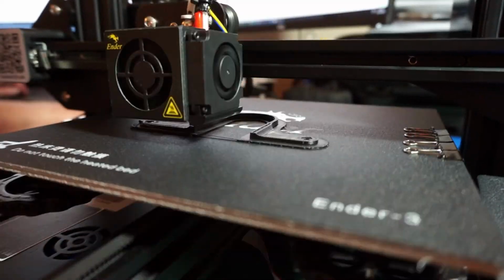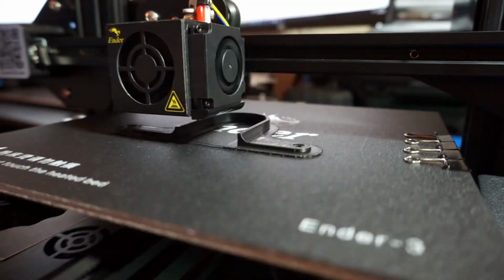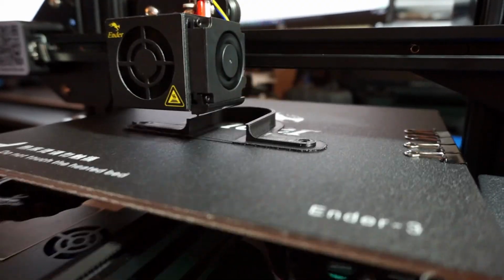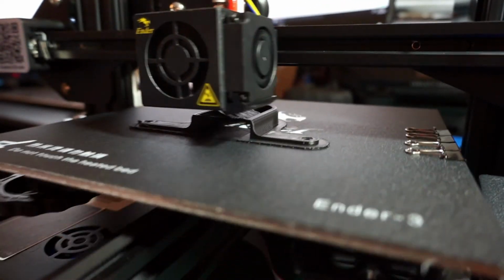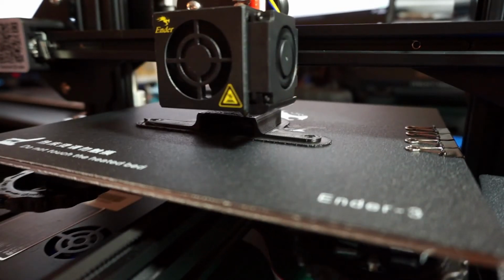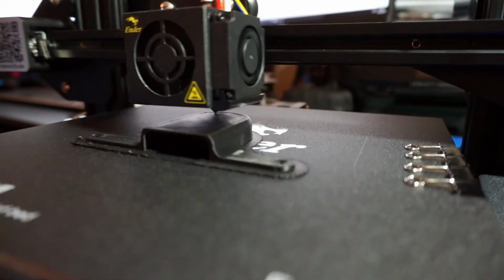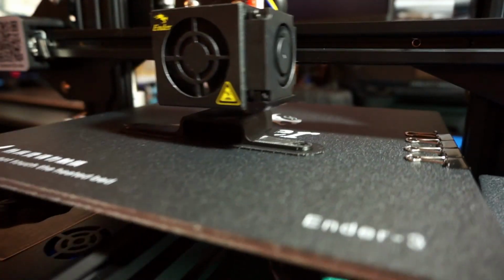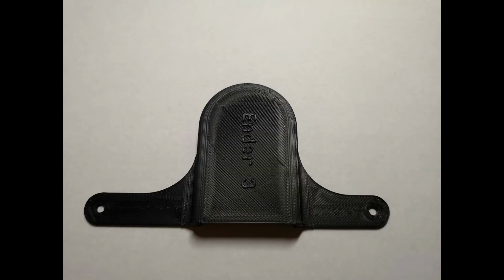Running the time lapse of the print that I did here, you will see if you watch through it where it spanned that one opening and the filament sagged a little bit like what you saw in the picture. I do still have quite a bit to learn here. You may have noticed in the time lapse that there was quite a bit of filament that had fed out before it started the print, which it then printed over the top of. Could be something that's causing some of my problems, but it's just one more thing that I've got to learn: how to get the settings for the printer correct and how to avoid things like that happening in the future.